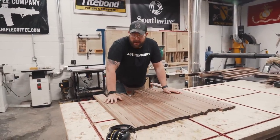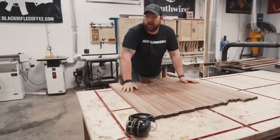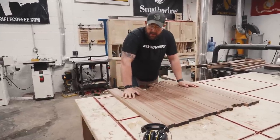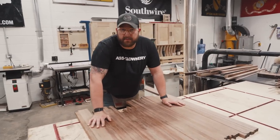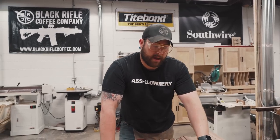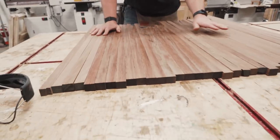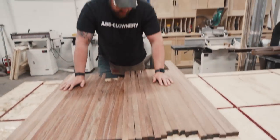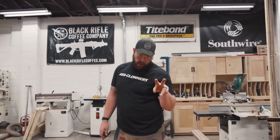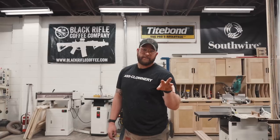What we're going to do now is make two 34-inch end grain cutting boards. We've got a bunch of glue-ups to do, and then a bunch of re-cutting and sawing. The only way to get these through my planer is to make them in 18-inch parts because I only have a 20-inch wide planer. Let's get to it — and to the boob sweat.